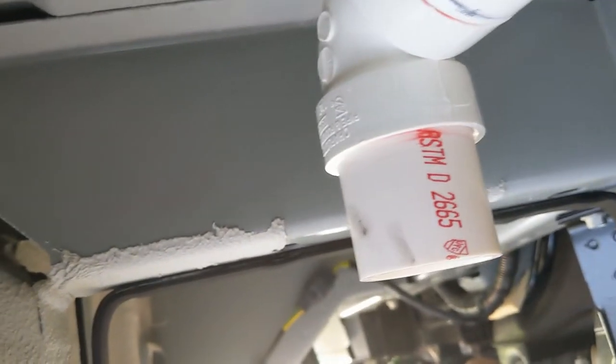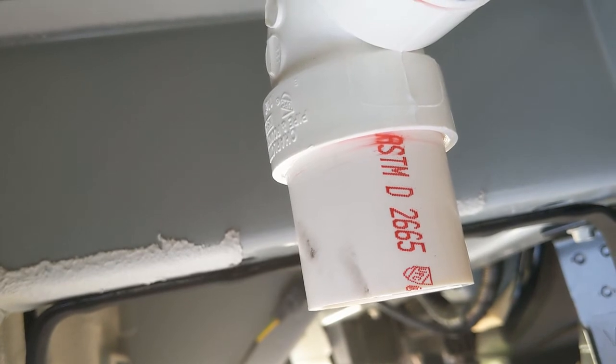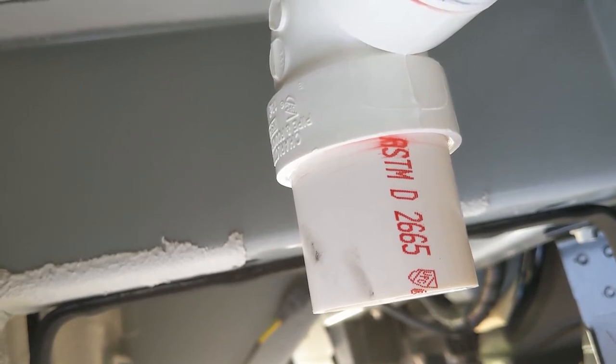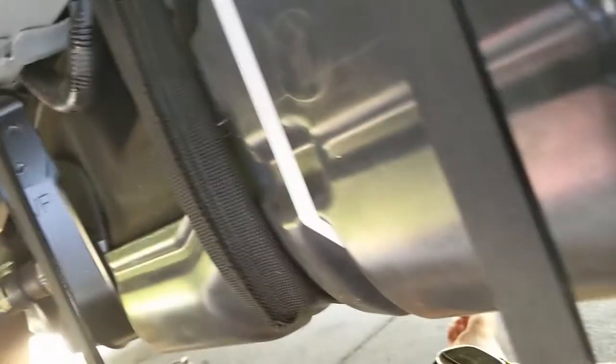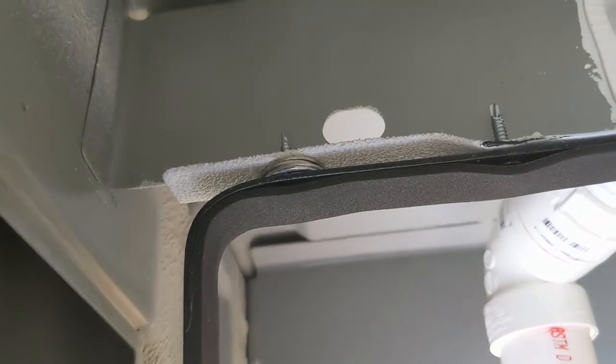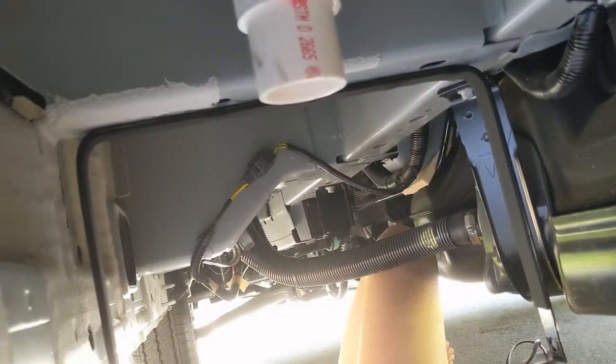So we're just gonna grease this up with some WD-40 all the way around. Make sure the grommet's kind of soaking with it, and then we're just gonna brute force push it up in there, and then we're going to put the brackets back on with this new foam trim that we ordered on Amazon. That's a lot smaller. I actually might even cover these foam pieces with WD-40 just so there's no friction pushing it up. That's what I want to do. See you in the next video.